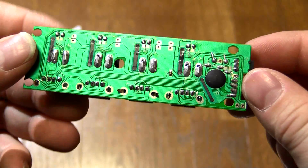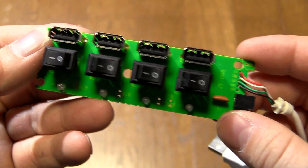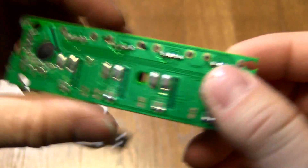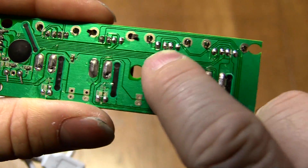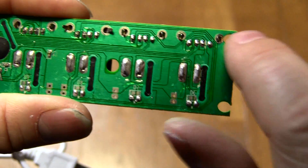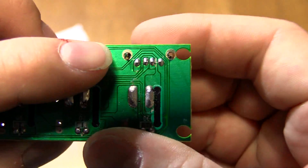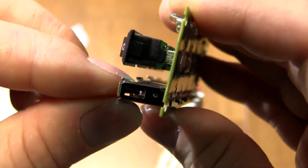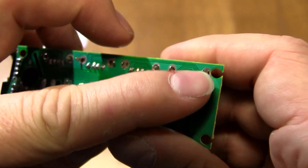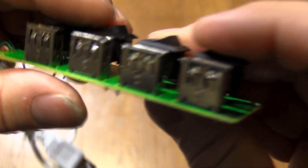Four switches, four USB ports. These must have been hand-soldered, because if it was wave-soldered every point would be soldered. But they haven't soldered the strain relief, which is a little bit dodgy because it means the cable can wiggle — that's no good. So before I use this in my next project, I'm going to solder those strain relief clips, which will make it a lot more solid.